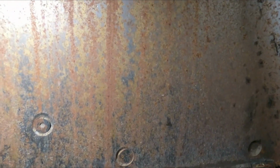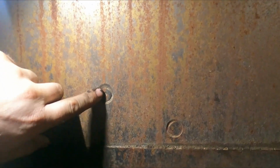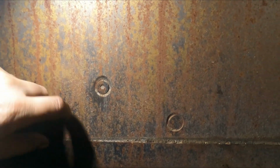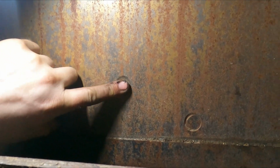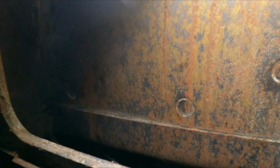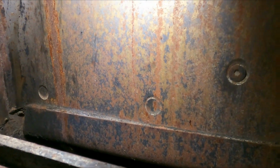The next telltale signs of premature wear is where the screws are. If the screw heads are starting to wear away, you know, when they're new, there is a couple of millimeters or a millimeter between the level of the wear plate and the head of the screw. So if the screw is starting to wear away, then you know you haven't got all that long.